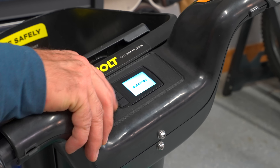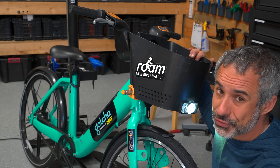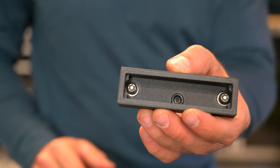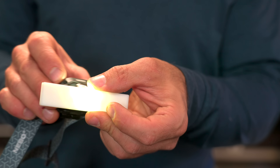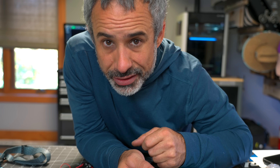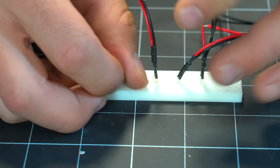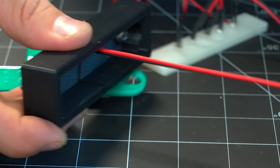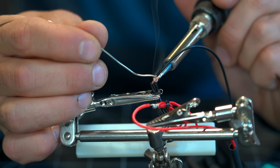The tail light is another story, because as I mentioned we don't even have one — we're going to make one. This is a little enclosure I made with a grommet at the back for the wire, and this translucent piece is the lens with little holes where the LEDs are going to go. Of course this was just another excuse to model and 3D print something — it's like my little reward for completing the whole bike. These little red LEDs are going to do just fine; I know they're stable at six volts, which is perfect.